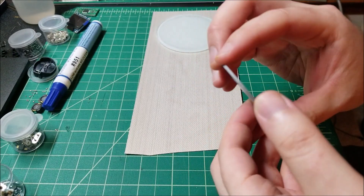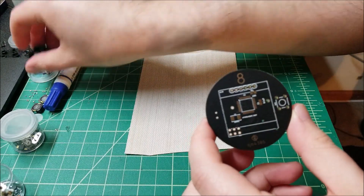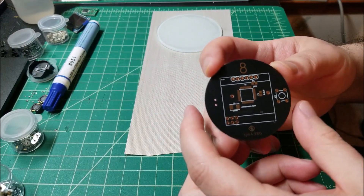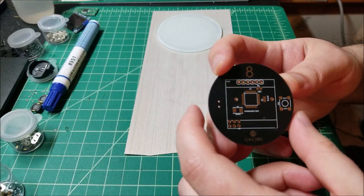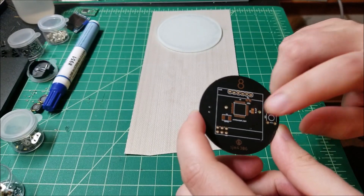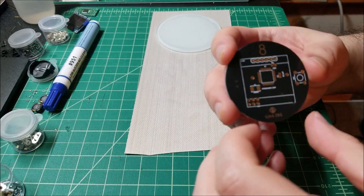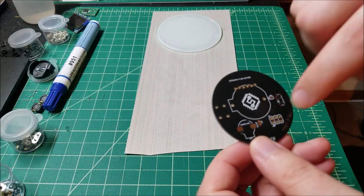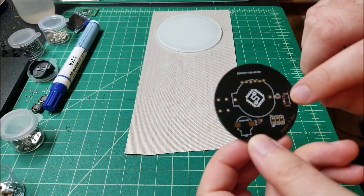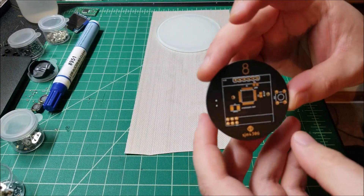This is a very minimal design. You don't have to solder a power switch or anything — it can run straight off a CR2032 using one of these little clip battery holders. The chip goes to sleep when not in use, so this should last a year or two using the power-down state on the ATmega. All we really have is the chip, the ATmega crystal, a pull-up resistor, and a capacitor. There's also an ICSP header for in-circuit programming, a buzzer which isn't strictly necessary, a switch, and a jumper you can cut if you're worried about battery life in standby.